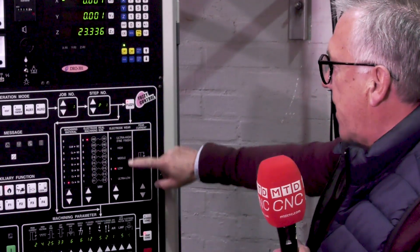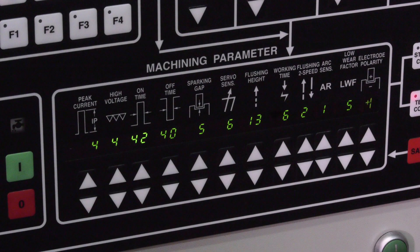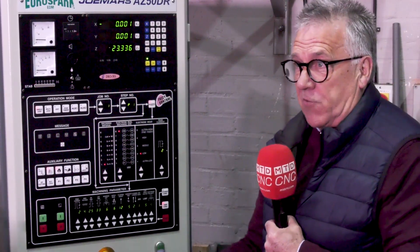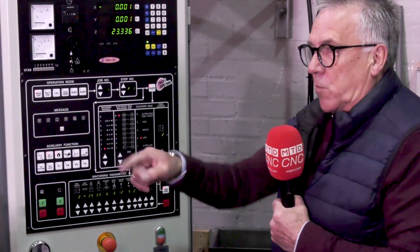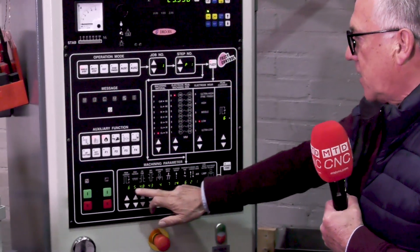Once you've got that, you then select whether you want a fine finish with high electrode wear, a medium-high electrode wear, or an ultra-low — which is slow. You can go for a low setting which is in-between: you still get good stock removal, a good surface finish, and reasonably good electrode wear. To work out what amperage to use, the average for copper is five amps per centimeter squared, and for a medium-density graphite electrode it's eight amps per centimeter squared. If you work out your surface area at five amps per centimeter squared, this machine goes four or six, so you put it to the higher one — and all the numbers in the machining parameters change automatically, because we're in fuzzy mode.